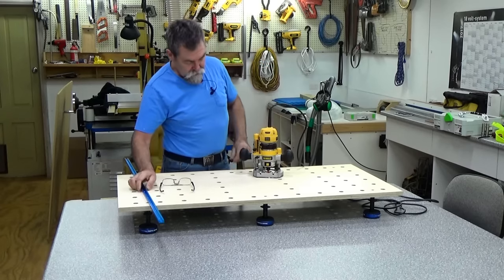I'm not going to drive it all the way down at the moment. What I'll do is go along with a block and give it a tap, then screw it in. Now I'm going to put a couple of anti-slip tracks in there. I'm going to use a little bit of this anti-slip material that is designed to go underneath Festool tracks — it's pretty handy stuff, works very well. I can't see why it won't work on the top. That will be instead of using a router mat — I should be able to put things on here and they won't slide around. It's about three millimeters thick, maybe slightly less, and it does compress pretty well. So I'm going to recess it in two millimeters using the same cutter as I did for the track — it's exactly the same width. I might do two runs with it.